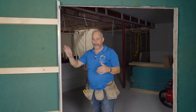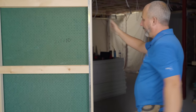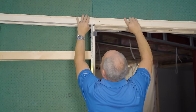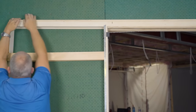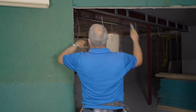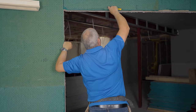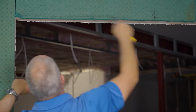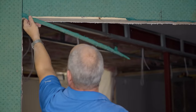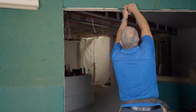We're sacrificing a little quality here because this is the only window and if we don't have pocket doors there's no daylight coming into the rest of the space. The sound quality in this room for a basement is already amazing — it's not just sound separation, it's sound management. I've trimmed the green board slightly, the pocket door frame is in, and now we need to set everything level, transfer the centerline, and plan for a two-door system so it's continuous all the way through. I'll cut the frame off so it runs continuously — and I may end up taking it away and re-trimming later.